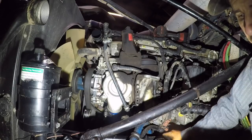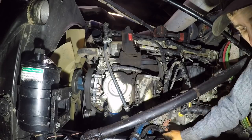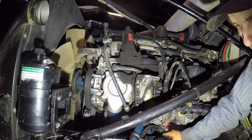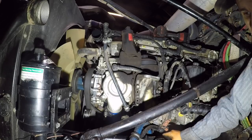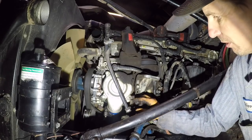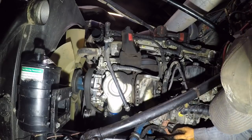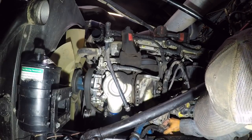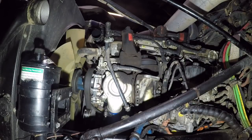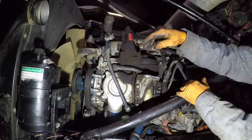I think the tool would work fine if you were working on something that didn't sit so high. Where it's sitting on that hub, it's too high, and you can't get your torch low enough to cut right without taking that shield and all that stuff off. If you were cutting out a flat piece of plate, say you set that centerpiece on there with the center punch hole in it, and you wanted to cut a flange out, it's called the flange wizard. So I don't think it's really made for what I'm trying to do with it, for one thing.